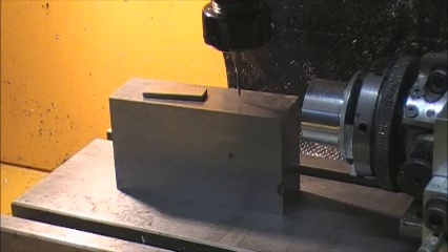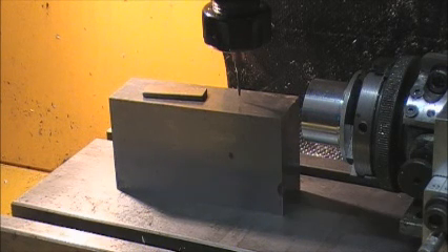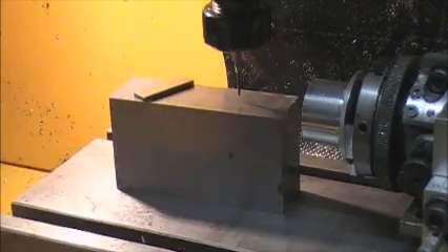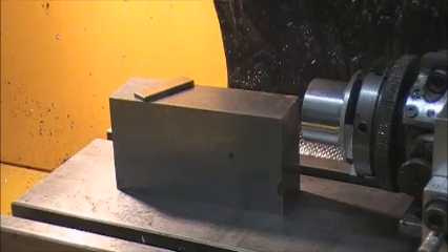There it's sliding under. That's tool number three — the 1.6 millimetre cutter — and the offset to enter in the machine program for this machining operation is minus 47.01 millimetres. That's for tool number three.